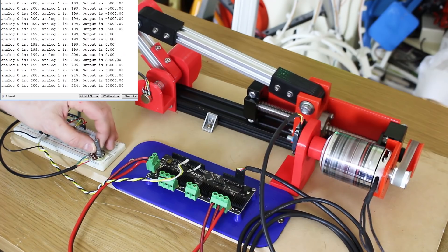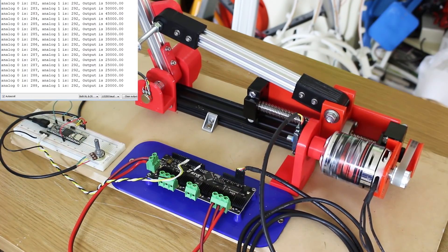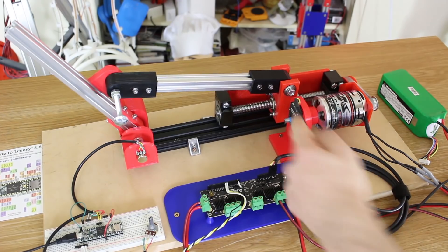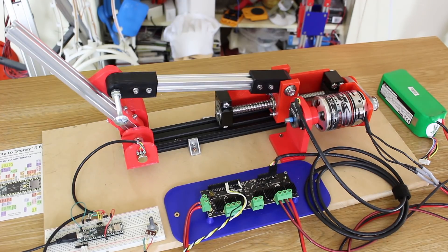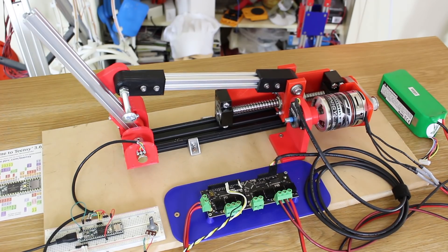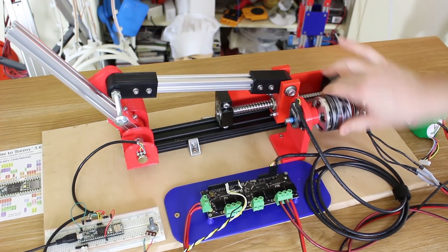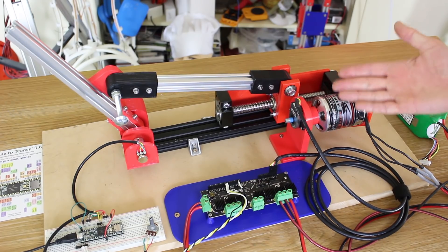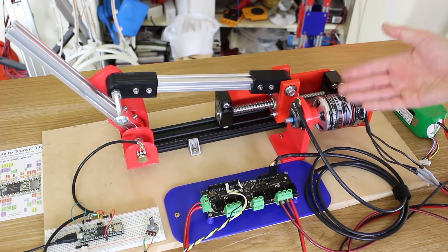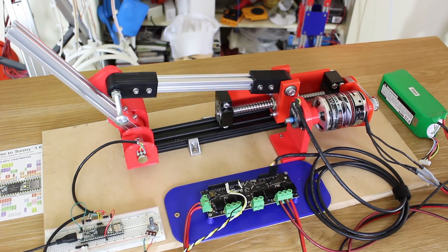This works okay, but I'm not sure it's absolutely the right answer. Now running in position mode using the encoder and keeping position control within the ODrive — sending commands over the serial terminal instead of the analog pot, with no analog pots in the mix at all — you'll see it's extremely precise with no motor jitter. The motor is held really well, using that encoder with all those counts per revolution to position it, and when it's still it's extremely stable. That's how we're currently using the ODrives in OpenDog.